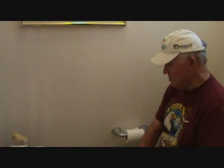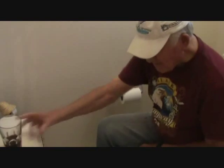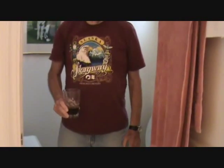Do you remember the height? Isn't it 33 inches by code? 33 to 38 somewhere in there — 33 to 34 inches. I've been a contractor and used to inspect work too. It's 33 inches to the center. I hope they put grab bar backing in there. We can check it — I know how to check it without making a hole. You can use an electronic stud finder. I think you should put the grab bar behind you and one off to the right, so you can go like this and push up. Well, you get the grab bars and we'll make a nice little video to show people how to install some grab bars.